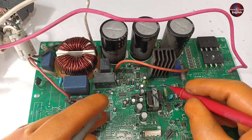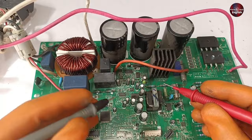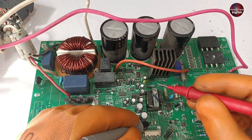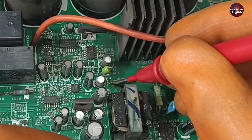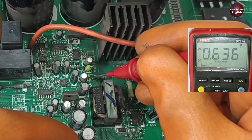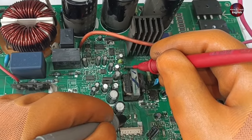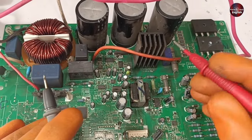Now I will measure the DC link of this circuit board. To check this, I connect one probe of the multimeter to the ground, which is also present on this soldering pad. I will check the voltages on this resistor — about 3 volts is what the multimeter is telling us, which is perfectly fine. As the currents and voltages increase, so will the reading on this resistor. This lets the microcontroller know that all functions are working properly.